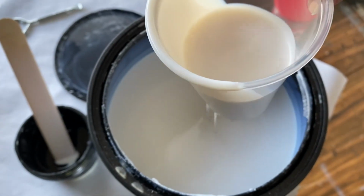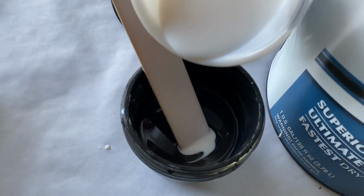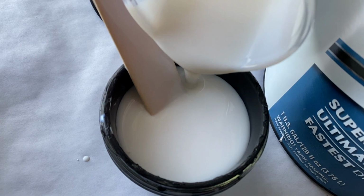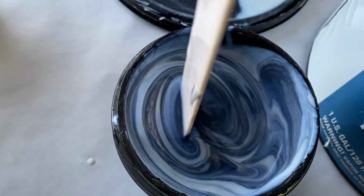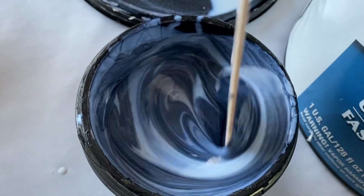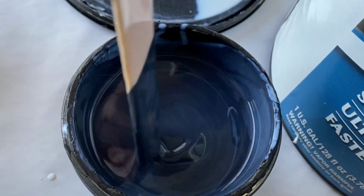This also can be the barrier between an actual clear coat, if you want to go full on with a nice thick water-based polyurethane clear coat over top. So if you let this dry like 24 hours and then go over top of it with just plain water-based polyurethane, you'll have even more durability. And you might want to do that for the top of this since it's a side table, or maybe it'll end up being a nightstand and people may put drinks on it.